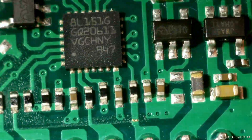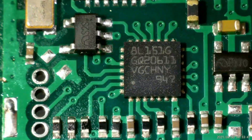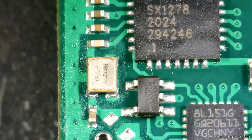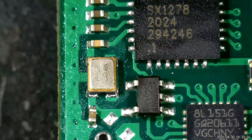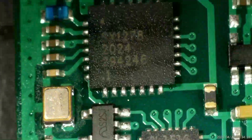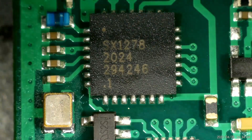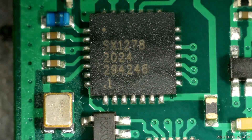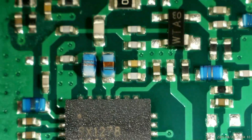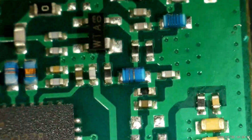This is our pinout and this is our comparator for UART. You can see the LoRa module is using UART. This is our crystal — it's an active crystal for the SX IC. This is a Semtech company IC, the SX1278.